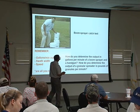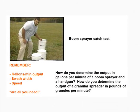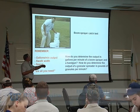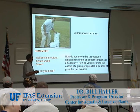This is a video that we did years ago, and you can buy the calibration tape from the University of Florida bookstore. Basically, what you do is you've got a sprayer, and you're putting out 4 or 5 hoses, you're dragging hoses. Put them in 5-gallon buckets and let it run for a couple of minutes, and then collect your buckets and see how, number one, uniform they are and what your total output of the pump is. And the same thing with a handgun. You take your handgun, you shoot it over towards the wall, you measure your swath width, and then shoot it into a garbage can with a plastic bag around it for 2 or 3 minutes.